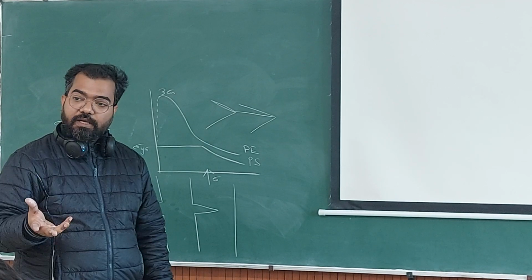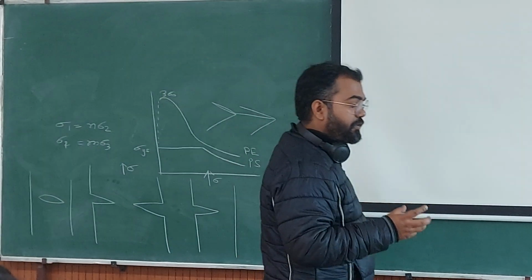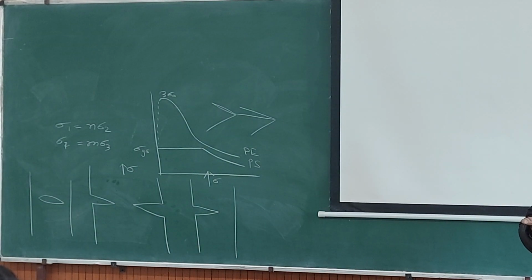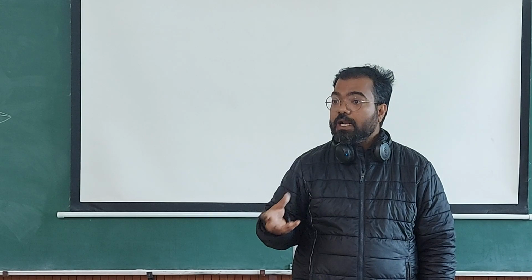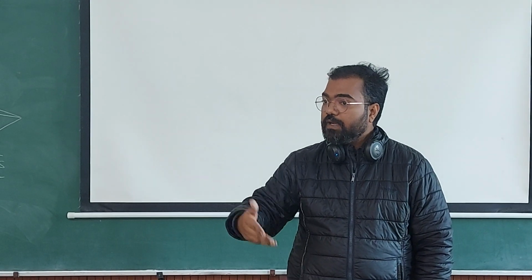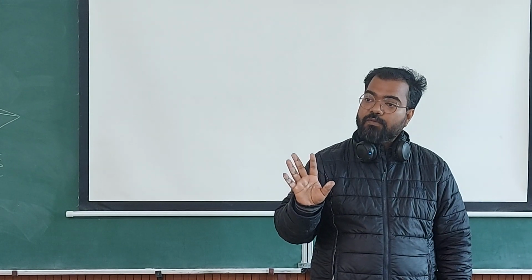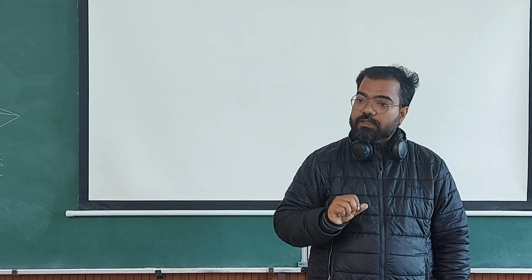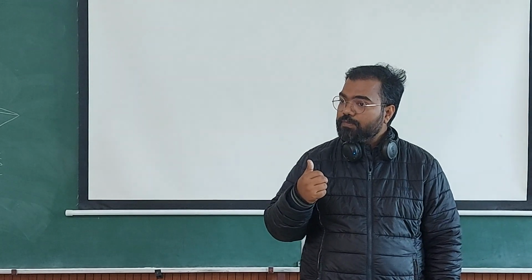No, you can plot T also, right? But usually what people do is they plot things in a normalized way, in dimensionless forms. Okay, if you plot T, then you need to know additional parameters like what sigma was applied, because T will change with sigma. If K is increasing for the same geometry, if you apply a K of 10 megapascal root meter, T stress will have some value, right? Then if you apply K equal to 400, T will have a different value, right?